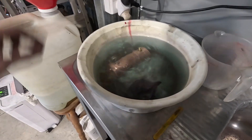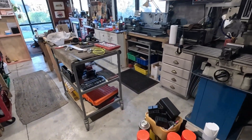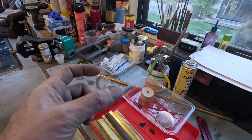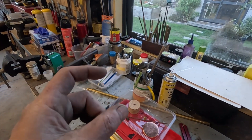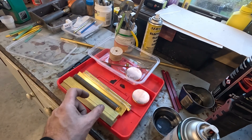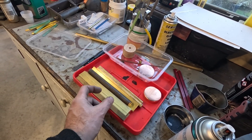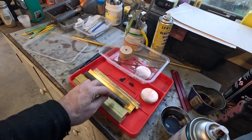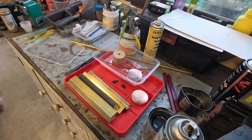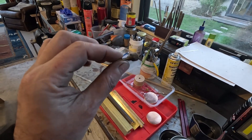I'm basically going to copy the Mammod dimensions - the little piston, cylinders, and ports. I'm going to try to do the same sort of reverser mechanism they use on the traction engine, which works because the whole piston and cylinder oscillates on a little eccentric. As you move the lever it moves up and down, changing the port direction - effectively so instead of exhaust being on the top it's on the bottom, which reverses the direction, as they would say on Doctor Who and Star Trek.